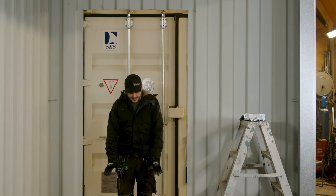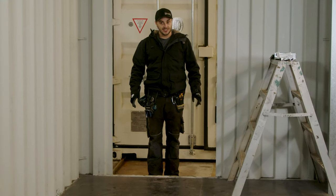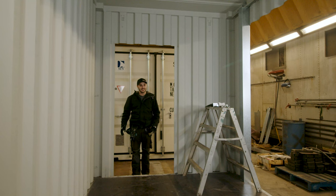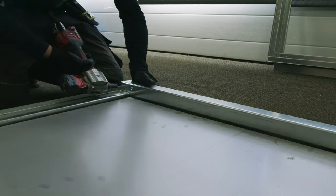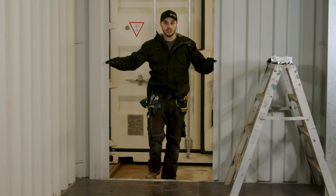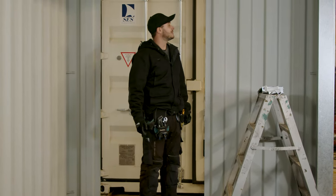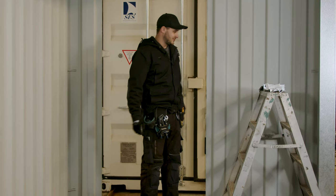One last thing: at the bottom corners of these man doors, we actually have to grind the corrugations flush. I don't like grinding all the welds — I like to just cut right on top of the weld, leave the weld, and then install the frames afterwards because that job is more work and it's loud and makes a lot of grinder dust. The new frame has an adjusted header and footer so that the rivets connecting the side frames are on the outside of the container and no longer in the way, making the footer more solid when you step on it.